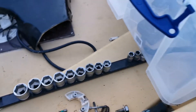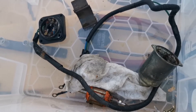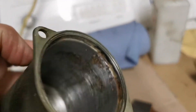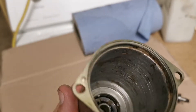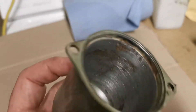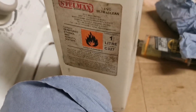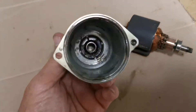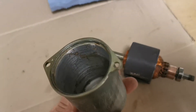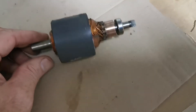I'm going to clean down this motor housing now and see if I can get that glued tonight so it's ready for tomorrow. I've cleaned it up now — cleaned around inside with some coarse sandpaper, got some grooves in there. I've put Stalmax cleaner — a bit like acetone — in there, degreased it all, scored it up with heavy grit sandpaper. That's clean and ready. Also cleaned up the armature on the motor.